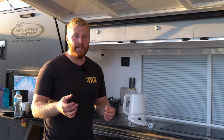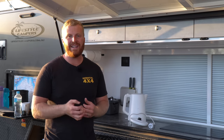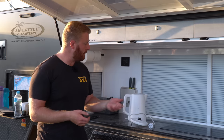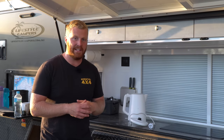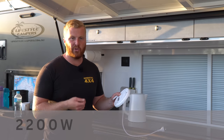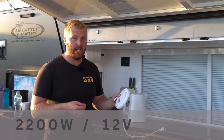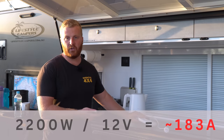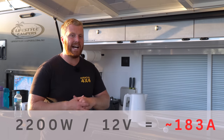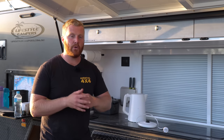There's almost an indefinite range of appliances that you can use with a 240-volt inverter, but to see whether a particular appliance will work in your setup, there is quite a simple calculation. For example, let's use this 240-volt kettle here — you find the appliance and they'll all have a tag somewhere on them that will give you a power in wattage. This one here is at 2,200 watts. All you do is divide that by 12. This will give you a rough estimate on how many amps it will draw from a 12-volt source — in this case about 183 amps. It's not a perfect figure, but it will give you a very good starting point.